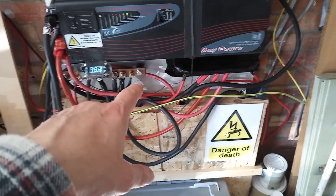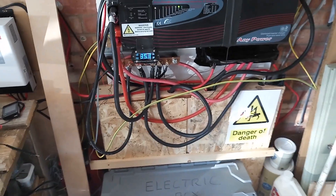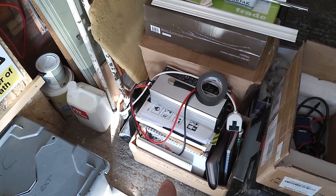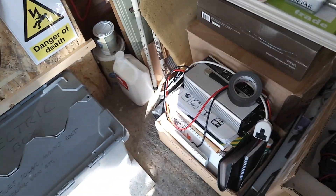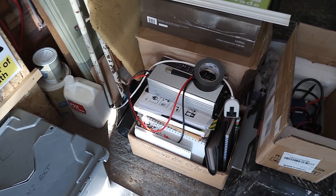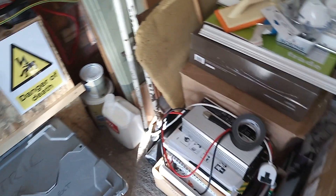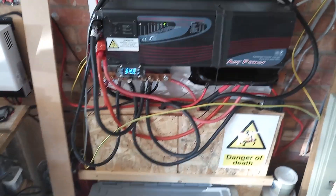Get the negative side boxed in, the positive side boxed in, get the shunt in there, get the BMV up and running, and then I'm going to use the relay to trigger a system which — if it's low voltage — will then kick this charger in. The charger is specially set at 24.2 volts, so that'll only charge them up to probably about 70 to 80%, which is fine because I'm only going to need that in the winter when the batteries go down — it'll just top them up a bit but won't charge them full.